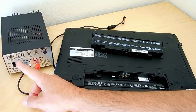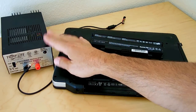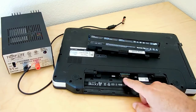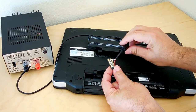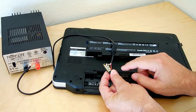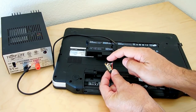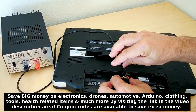Here you can see the older Tripp Lite precision regulated DC power supply with up to a 5-amp regulated output. When I removed the cover, the potentiometer was inside — I just measured the DC voltage off the two posts and reduced it from 13.8V down to 12.6V. For the connector, I made sure it was positioned correctly so when inserted upside-down it works properly. Battery negative goes to the two pins on that end, with a jumper from the end to pin 5 for negative, and the far right two pins carry 12V positive.